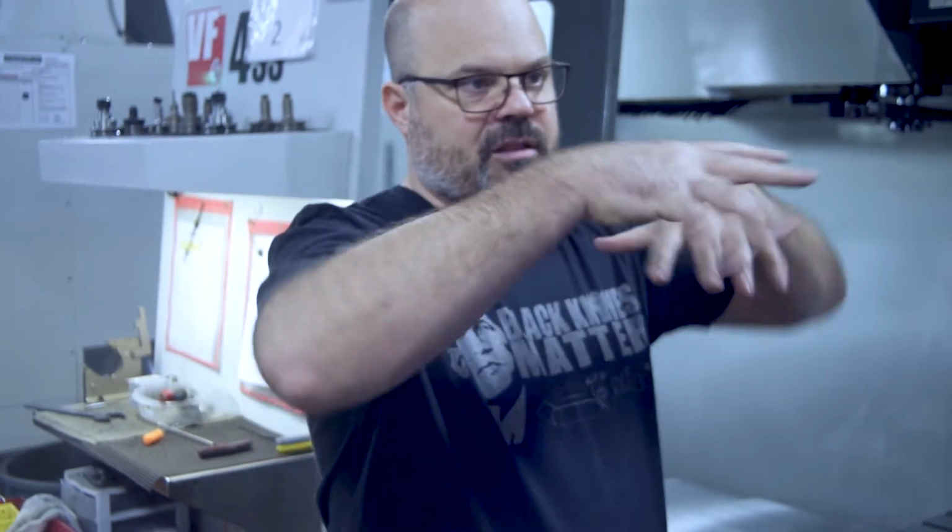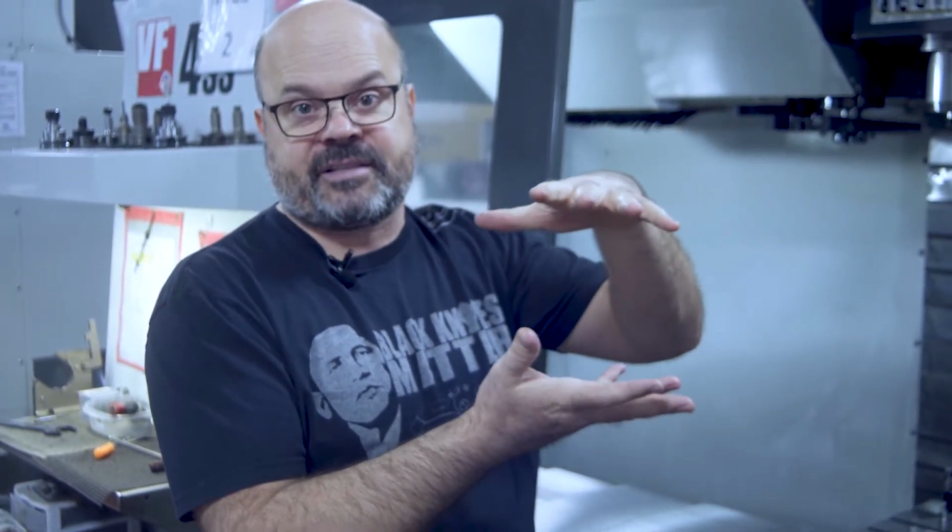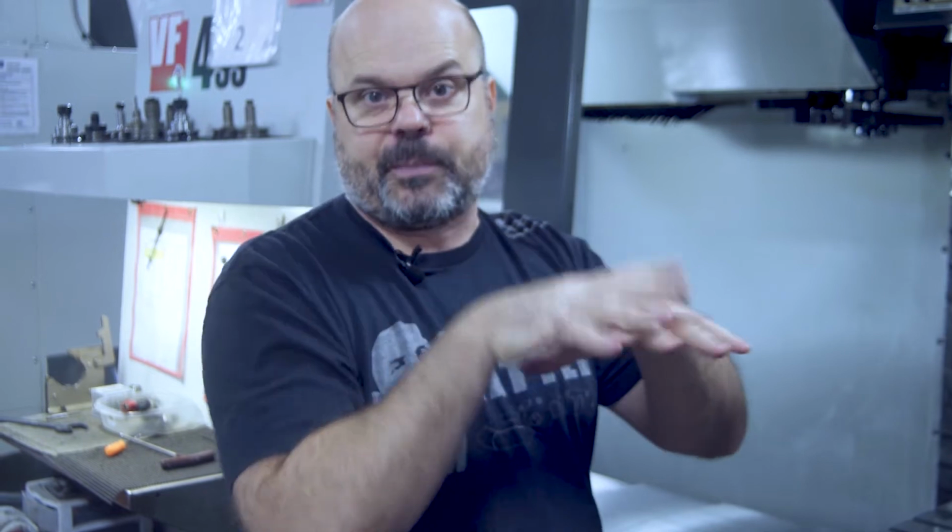it now comes into here, and now we've taken this piece of metal that has all this variance to it, and we've given two sides precision, parallel, and flatness. Then we put them on here. We make the sides square to the faces, and we make all the holes perpendicular to that. It means that every surface on your knife has been controlled and shaped for a consistency of end result.